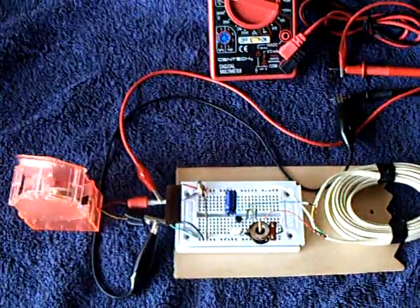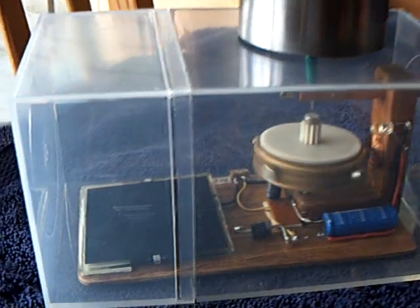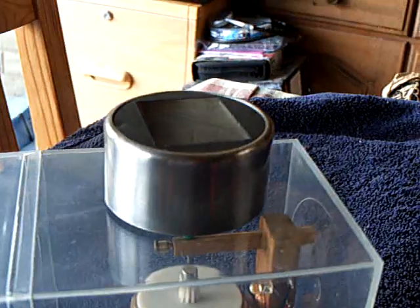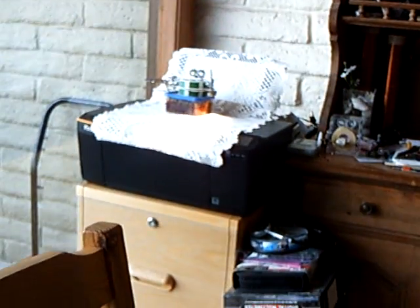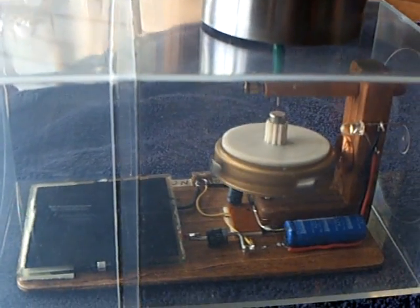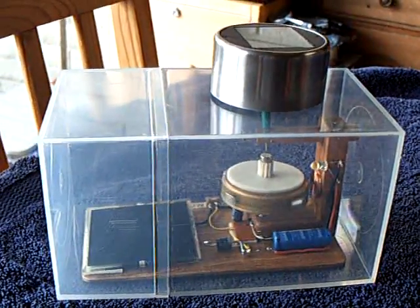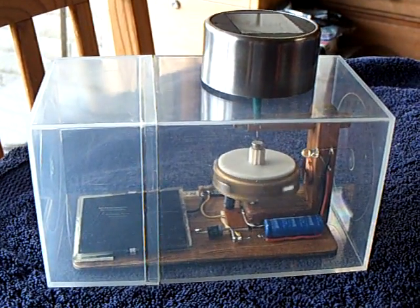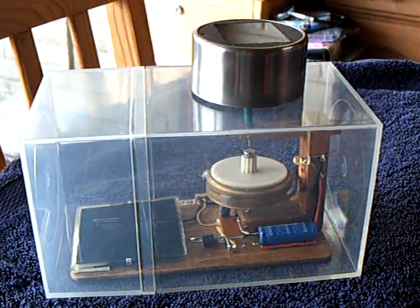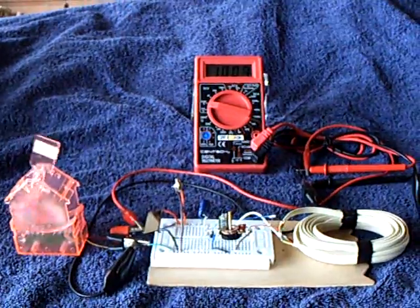That's what I've been doing — getting these devices to run nonstop. If I reduce the load down far enough, I can get these things to run day and night. That is my nonstop runner, and that's been running for months. I finally put it in a box — I went to a very big solar panel and a 10-farad super capacitor. That's a solar garden light so I can see it run at night, and it sits over there. It gets enough sunlight during the day that it runs all the time, day and night. I don't know what's going to happen this winter, but we'll see. That's what a spinner looks like that runs nonstop here in California. Thanks for watching.